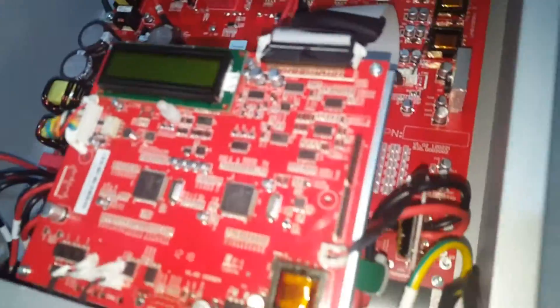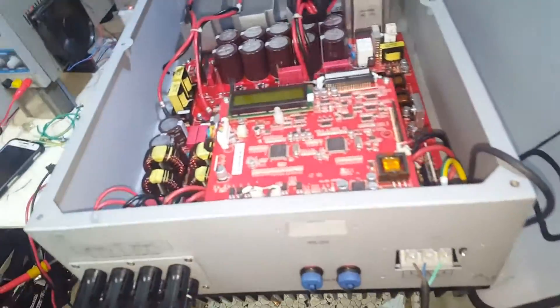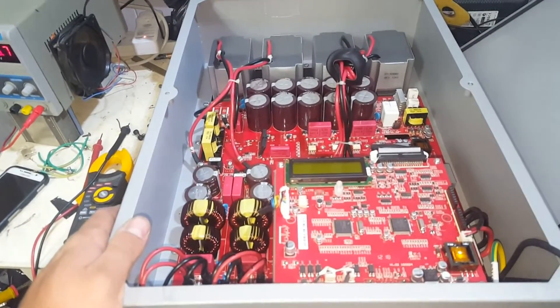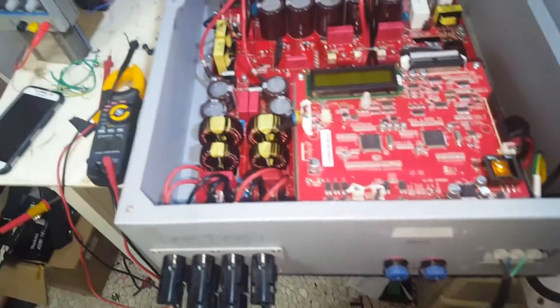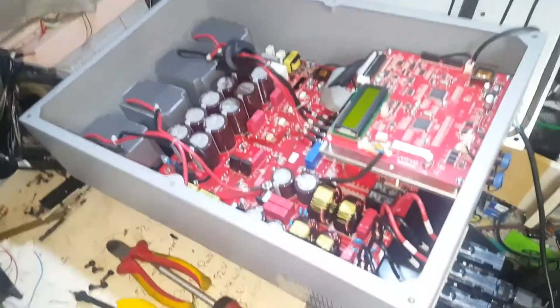That's pretty awesome — zero ohms, so that's a direct connection, zero resistance. Looks like some current measuring devices down there. The whole enclosure's earthed, so I figured I was going to be reasonably safe. The circuit I plugged it into is RCD protected, so if it's full of water or there's some kind of ground fault or current leakage inside the box, I thought I had a reasonable chance of being okay. I'm more worried about the DC side of things. I had to drop the energy out of these feed cables.